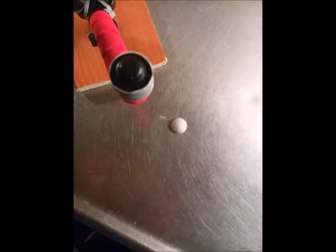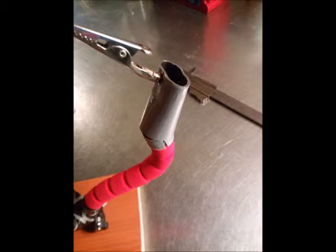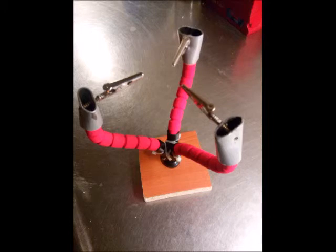Here I have fitted 1 leg with double sided tape — leave the second protective layer on. Repeat for all 3 legs. Now try to fit the tube and clamp assembly over the double sided tape without removing the protective layer. Remove it at the very end. You pull the layer down at an angle and it fits like a glove. Repeat for all 3 legs. Here you can see all 3 arms mounted.